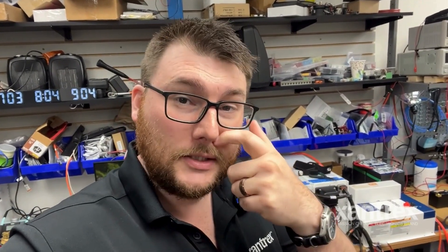There are several ways that recovery mode is useful. If you turn the vehicle on, that's an ignition source — that'll wake the batteries up. So if you're at a very low state of charge and you turn the vehicle on, it'll wake the batteries up and you have a 300-second timer that will start again, draining power along the way. Same thing with plugging into shore: if you plug it in and then unplug it quickly, it'll wake the batteries up and go into a 300-second countdown again. The only time it won't is with solar — solar is turned on by the batteries, so if the batteries are not on, solar is not active. So we won't have to worry about that one.